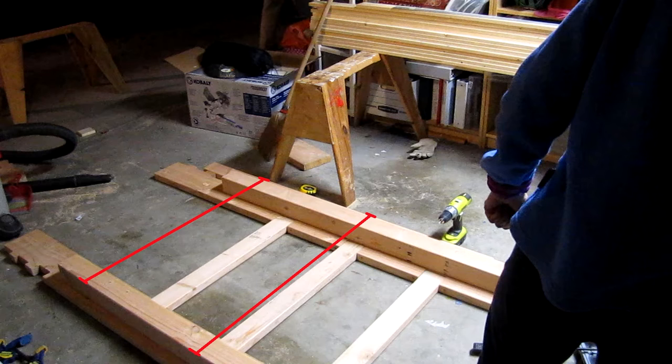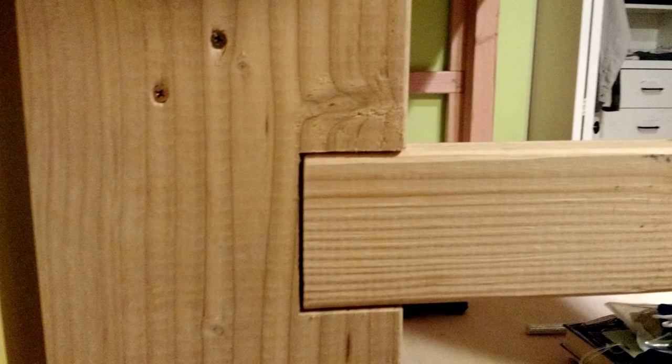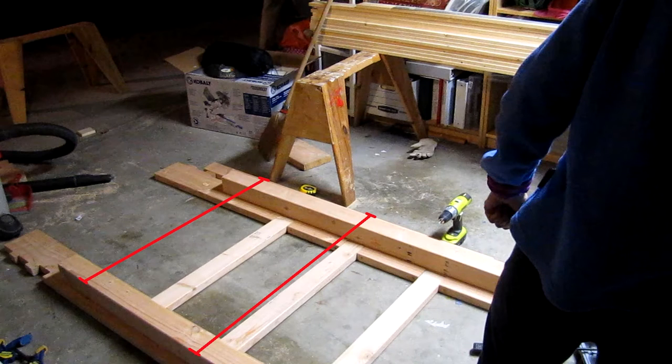But you could try measuring your bed, so place it on the ground, kind of in the position it would be like this one here, and measure from one side of the 4x4 to the other, and try and get that around 39 inches. And then measure the distance between the insides of the two cutouts, understanding that it's unlikely that you're going to get it perfectly flush. So if you measure it so that it had come out at 39, which is what I did, it ended up coming out at about 39 1/4, which gives the mattress a little bit of wiggle room.